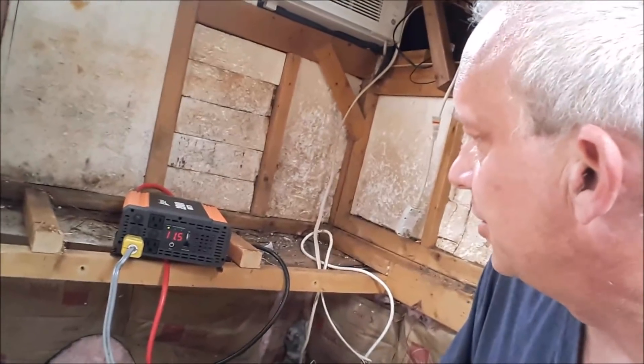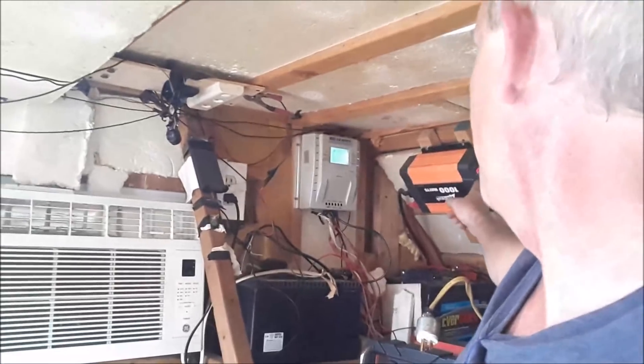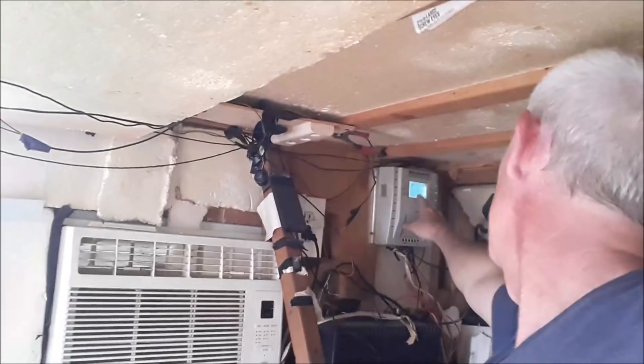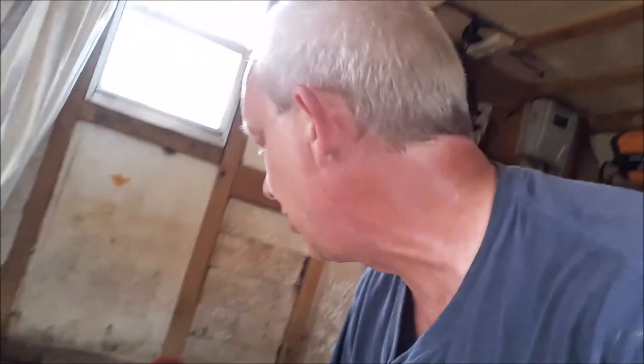I'll have to unplug it so the solar panels can continue to charge — we're already down to 11.4 and pretty soon the inverter will shut off. Right now the solar panels are normally capable of about 50 amps, but due to clouds we're only putting out 14 amps. The battery is starting to charge back up to 13.1. As soon as the sun pops back out we went up to 18 amps — it's fluctuating quite a bit based on cloudiness. This is going to work. I need to shut it off to avoid wasting power. I hope I can inspire you to find backup plans when you're living your dream — thanks for watching.